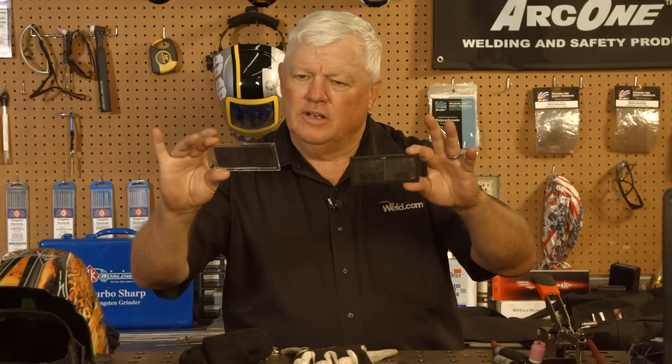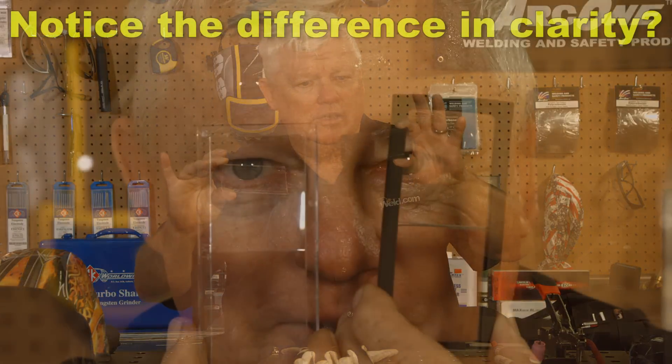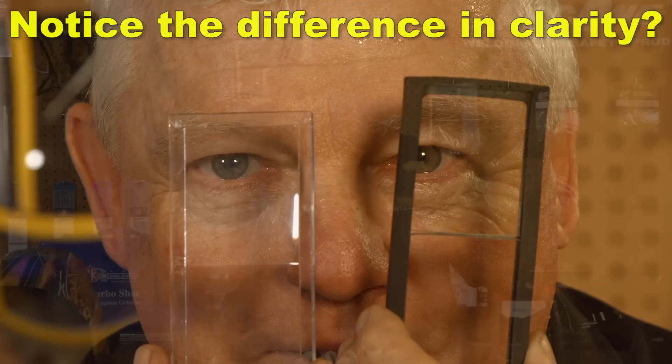But the glass ones will really never lose their clarity through distortion. It's hard to scratch them and you can clean them up. I could look through this plastic one right now — and this lens is less than a year old — and I can see distortion, cloudiness, and scratches that I put into it, and I take care of my helmets. The glass one here is just absolutely perfect. I'm going to show you through the camera how much difference there really is — call it 5 to 10%, but that extra 10% is going to make the difference.